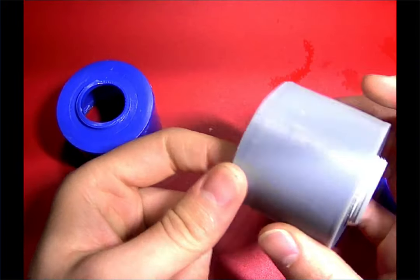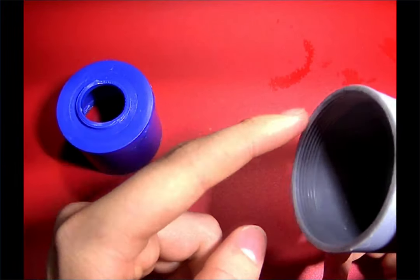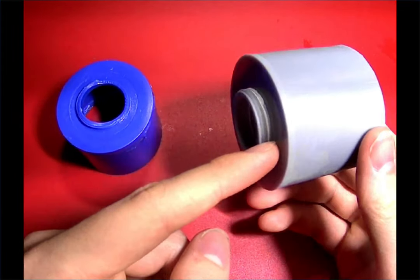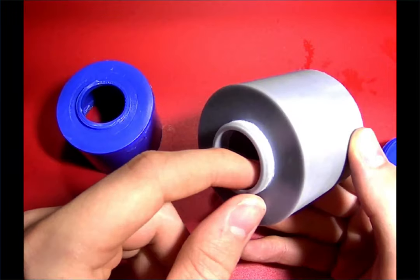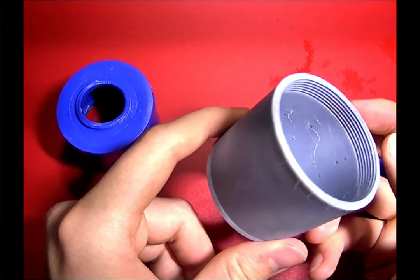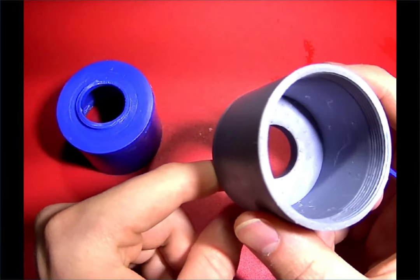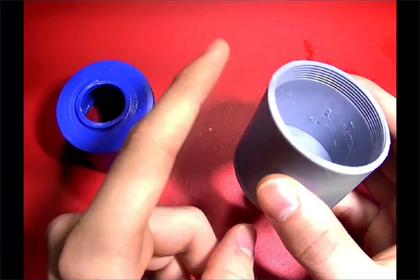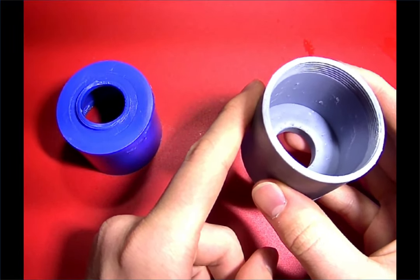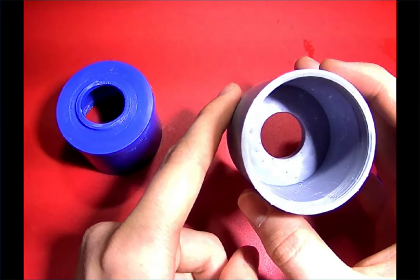It is a little bit extra difficult to get out but nothing too hard. I would call this a success. We ended up with two very obscure threads that weren't in the thread document I was looking at — it's possible these are a different type of thread I wasn't looking at; I was only looking at large metric threads. These could be some type of large metric pipe fitting thread. I assume they're metric because they line up with the 1.5 pitch pretty well. I'm going to deploy this solution into my machine.